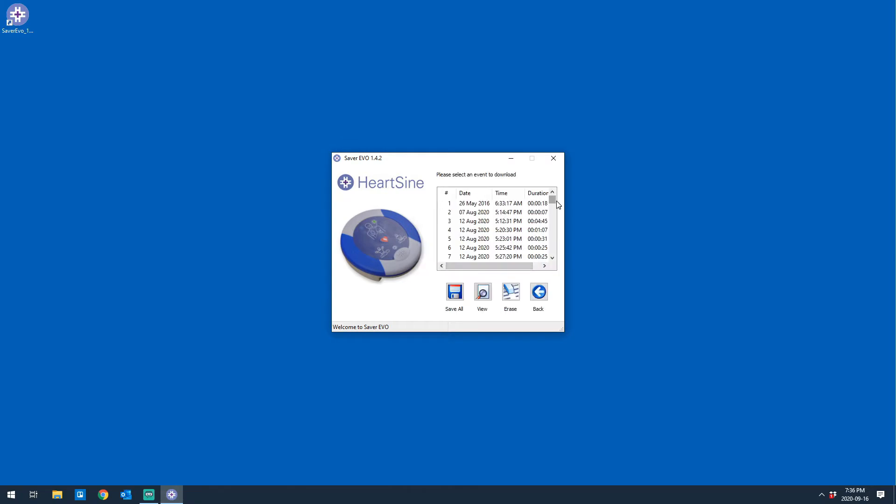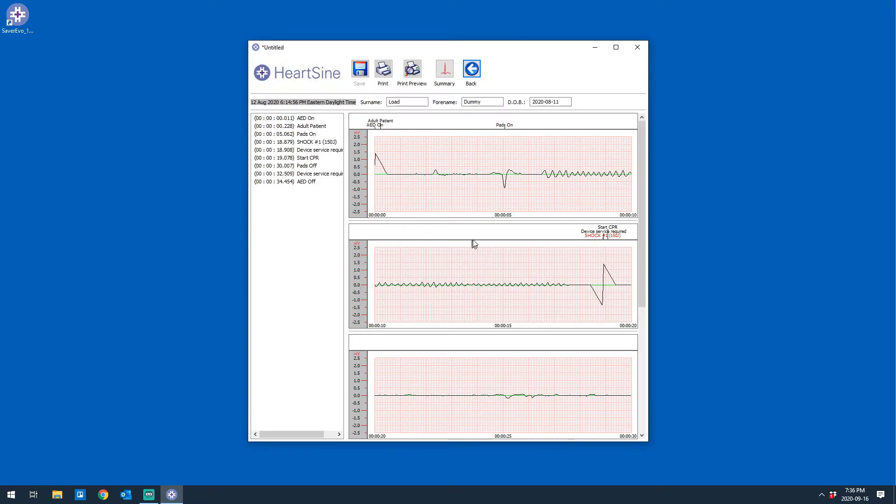So there's a whole bunch of different events here. I've already looked at this — I guess technically I'm editing this video a couple weeks late. Let's look at this particular event, because this is the one that actually discharged. We have all of the time logs here in a format equivalent to the strip chart that comes off of normal medical defibrillators. When they hook a patient up, they may have heart monitoring already built in and a paper tape coming out of the machine. It sensed within five seconds the pads were applied, and shaking the cable generated slight differences in potential between the two electrodes measured as a slight voltage — and the presence of this voltage fulfilled all the criteria required for the device to administer a shock.